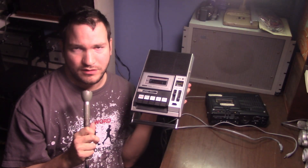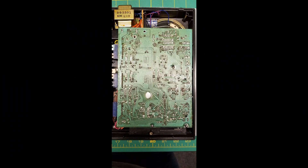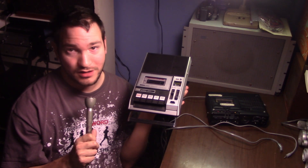I'll be showing a couple of still photos of the inside of the machine because the circuit board is quite astonishing — it's so unusual for a shoebox cassette recorder. There are many chips on this machine, three of them being bucket brigade devices, and notice all the chips are socketed. There are also some special VSC chips that are completely proprietary — I cannot find any data sheets or information on those chips at all. VSC wanted to keep those things top secret.